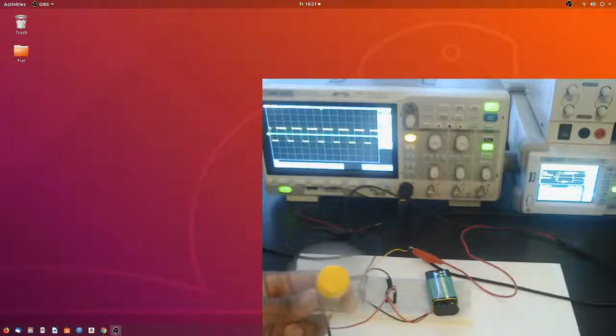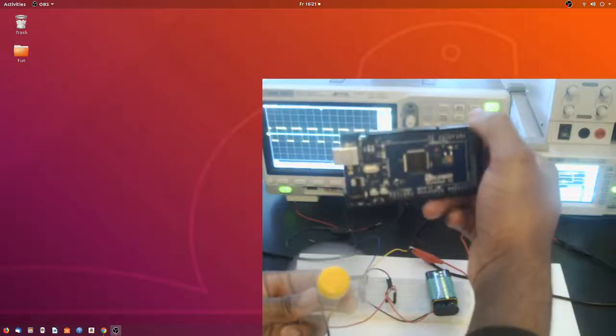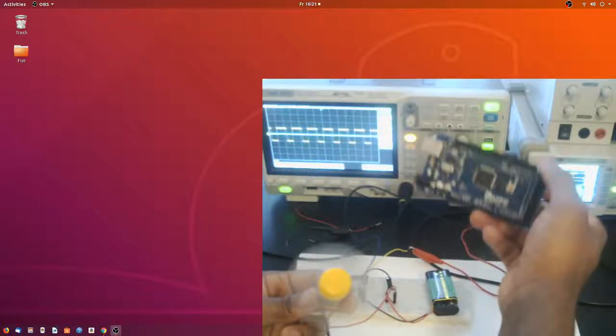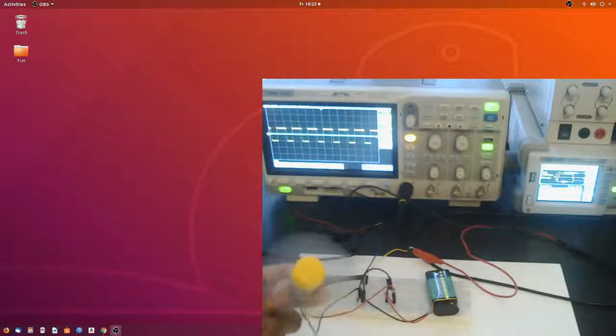The lesson here is that when it comes to controlling the speed of a DC motor, PWM — a pulse-width modulated signal — is what you need. What the Arduino was doing in the previous video was simply generating the PWM signal at the duty cycle and frequency needed to control motor speed. If there was anything special about the Arduino, it was just generating the PWM that controls how often the transistor turns on or off, and indirectly how fast the motor spins. Thank you for watching — leave any questions in the comments and I'll see you in the next video.